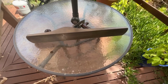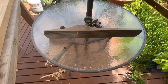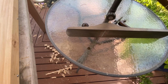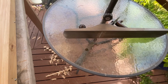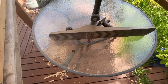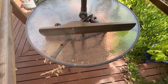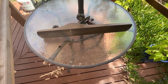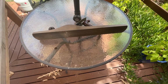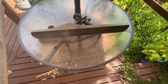This particular model is with the corrugated bottom. To be perfectly honest, I don't find much difference between the corrugated bottom and the non-corrugated bottom. Supposedly the corrugated bottom was put in to provide less friction on your working material, because it is such a heavy plane. The idea being that the full surface area uncorrugated would provide, with the weight of the plane, too much grip on the material and be too hard to push through.